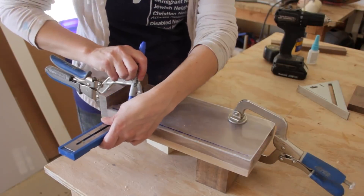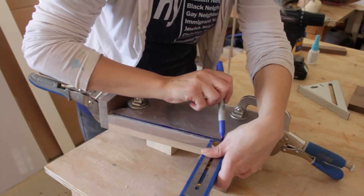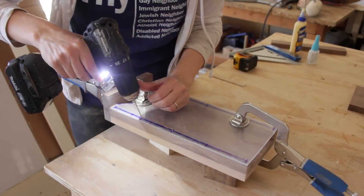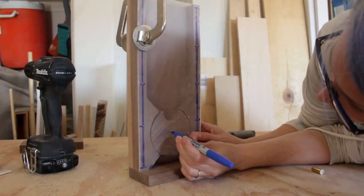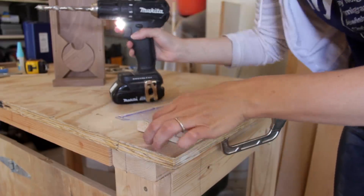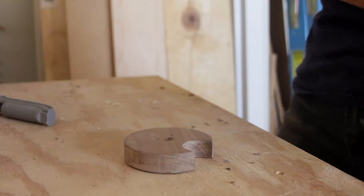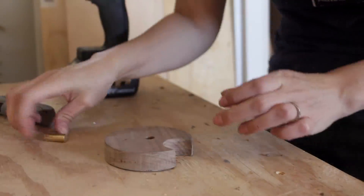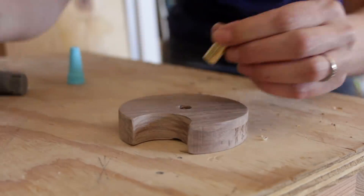I clamped the acrylic in place on top of the dispenser and marked where the screws were going to be located. I used a 1/16-inch drill bit to drill five holes on each side through the acrylic and into the wood beneath. While the acrylic was still clamped, I found the center of the dispenser and marked that as well. I removed the acrylic, clamped it to a scrap piece of wood, and drilled a 7/16-inch hole for the handle. I discovered a Brad point bit was not the way to go, so I quickly switched to a 3/8-inch Forstner bit. I used leftover 3/8-inch brass rod from a previous cutting board project for the handle, filled the hole with Rapid Fuse, and held the brass handle in place while it dried.